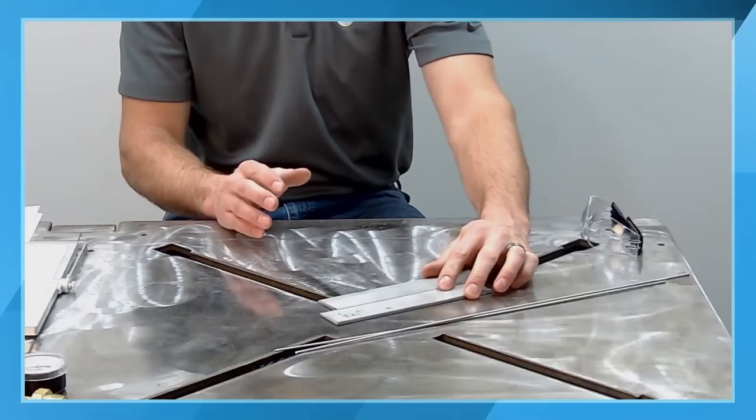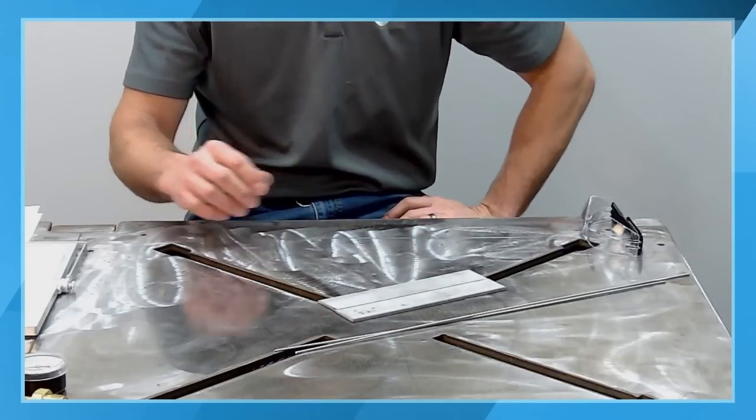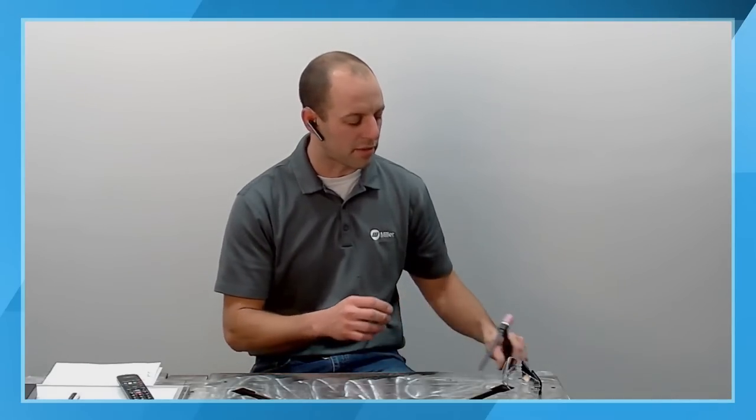You have to typically have a pipe joint, or maybe a straight weld. You're not going to have the kind of leniency with more complex joint geometries, things like exhaust headers, where you might be leaving little marks from your cup, or a lot of aerospace applications where you're doing aluminum. You have that heat transfer that makes the cup a little sticky, and with aluminum you have a little bit larger welding pool because of the thermal conductivity of that material. And so typically you're going to do a freehand style with that.